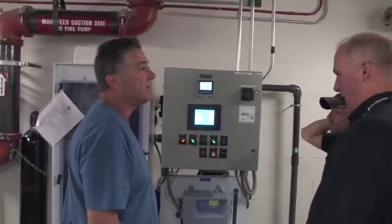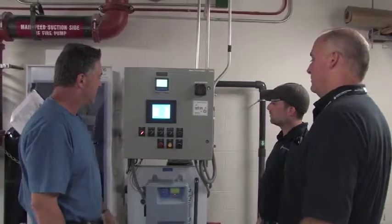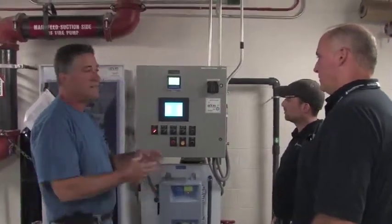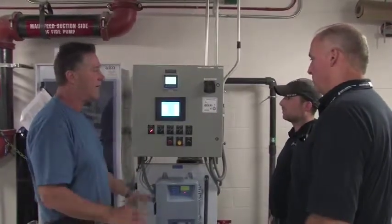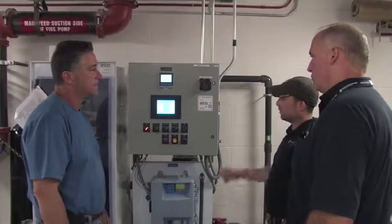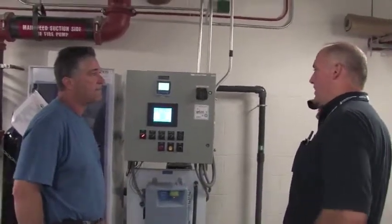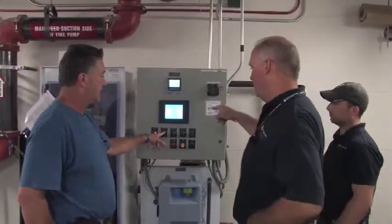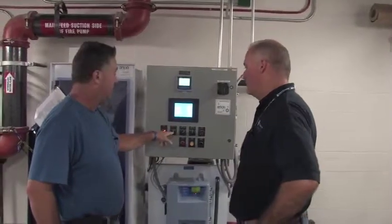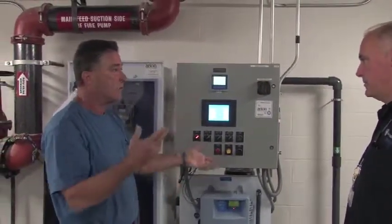So you've recirculated basically that whole tank twice already. This is how you're going to see everything in auto — pump will be off, and at eight o'clock on day six, day 15, day 27 of the month, this thing will be running. Once it meets its set point, it will turn off. In between the days there's absolutely nothing running. They'll get a conductivity reading off it. If they want to come in and do a reading, they will have to take it to hand — turn pump one or two to off, then to hand, and then they can get a reading. This is what you're going to see for everything in auto.